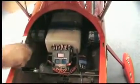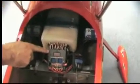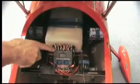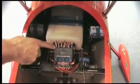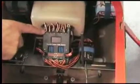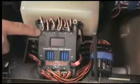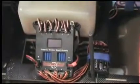It's got a 64-ounce fuel tank. It's got a Futaba fast system through it with a Powerbox Competition. Now I use a Powerbox Competition, it's a 12-channel one. I wanted to run all the aileron servos independently so I can play around with some differential and a few other odds and ends without getting too complicated by making adjustments through the Powerbox. This is a very simple setup.